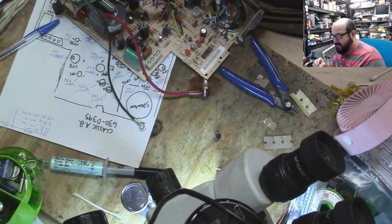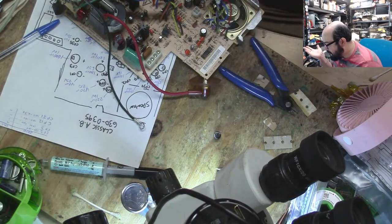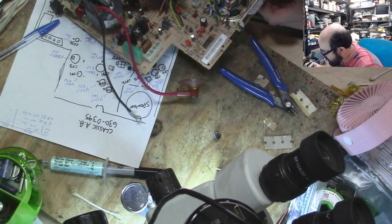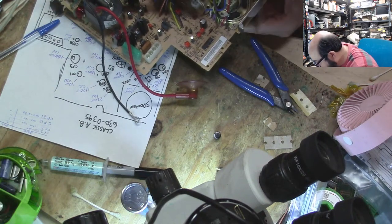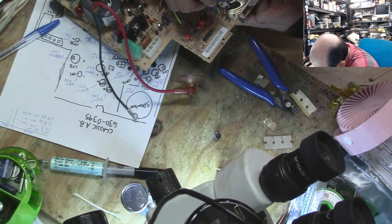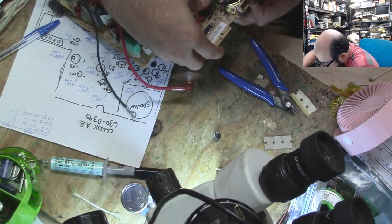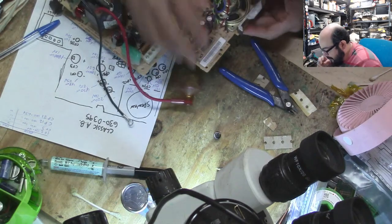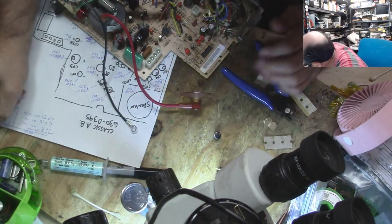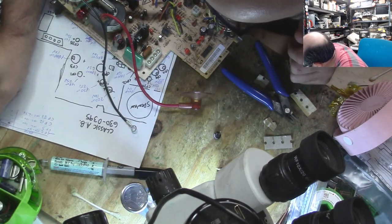So we have a 220, 50. Now that can only fit in CF2. So even though that's not a 16 volt, this is a 50 volt, they went quite high in the voltage here, but I'm going to allow it, because that's the only one I have to put in there. Okay. Now, that's done. So let me mark this down. So they did a 50 volt one of that.